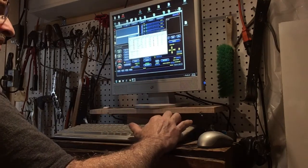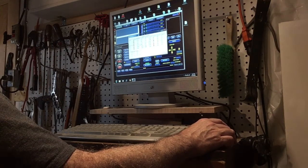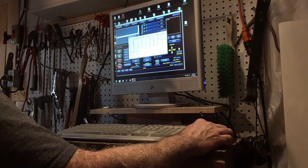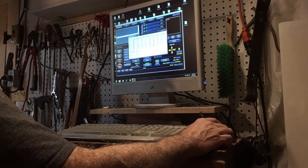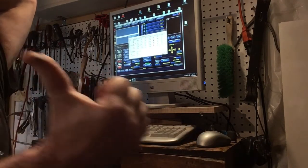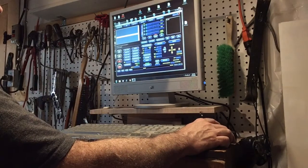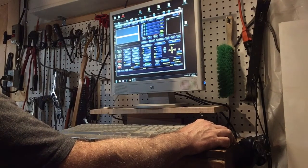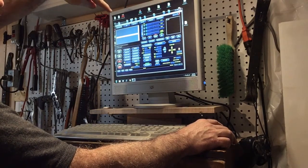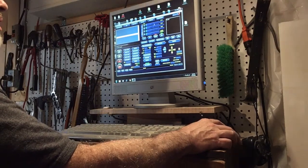My A axis is the same because I have a slaved axis. I don't think that matters either. There's only one direction, and that's forward, and that's what I call Y. So then you will do the exact same thing over that way to the extreme positive of X, and that enables this button right here, this button called Ref All Home, to turn these coordinates to 0.